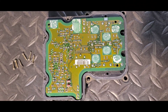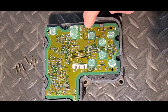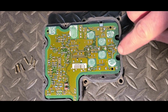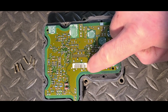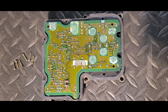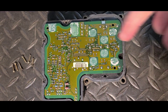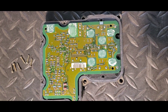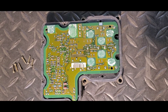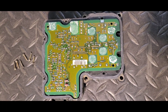Now that the case is open, I'm going to get out my soldering iron and get all of the big pin soldering points here. They tend to crack over time and get a bad connection. Look for the duller ones — they are usually the culprits — but go ahead and just hit them all with a little bit of rosin core solder, and hopefully it fixes up the card.